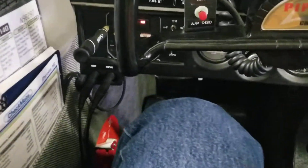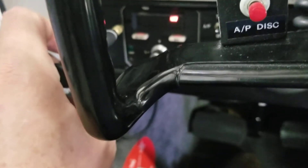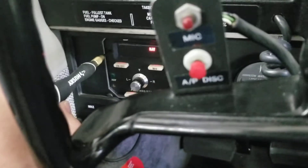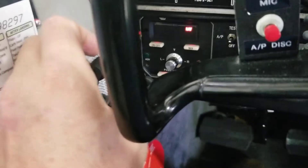Just a quick recap of the calibration I did on the autopilot. The key here: you've got to have a 1/16th inch screwdriver that goes back in this hole. There's a screw that comes out, you put this in, and there's a potentiometer back there that you have to turn with this. They specify a special tool, but really the tool is just a small screwdriver.